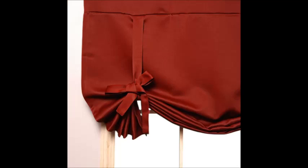Another very effective option is heavy thermal curtains, and these work equally well in the summer and the winter. One important thing to note: the curtains need to be flushed to the window frame, sort of like a Roman blind style. If it's sitting away from the window frame, especially in the winter, all the cold air that comes in through the window is just going to be sucked down into the room — you've got to create that dead air pocket. I made thermal blinds last year, three heavy layers, and I actually put a fourth layer in with a Mylar blanket in between them. I'm amazed at how cool it keeps the house in the summer and it helps tremendously with keeping it warm in the winter.